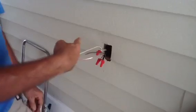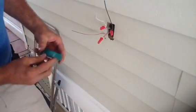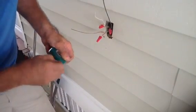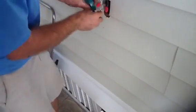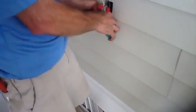This one is now ready for the GFI to be put in. This is what we call the line side of the GFI. We're going to go ahead and tape this ground wire just to make sure everything is good — we refer to this as a tape lock.